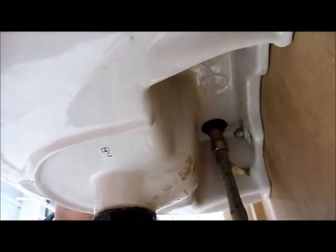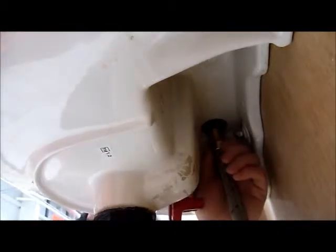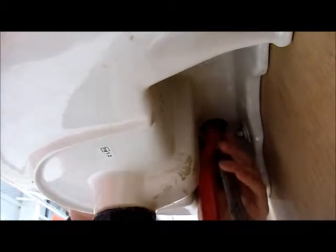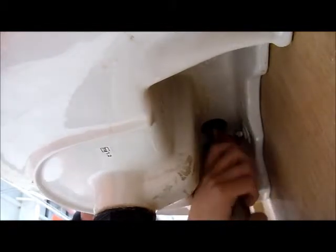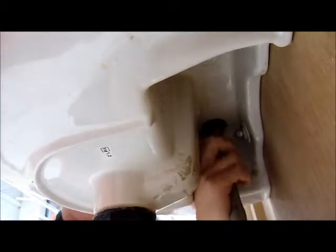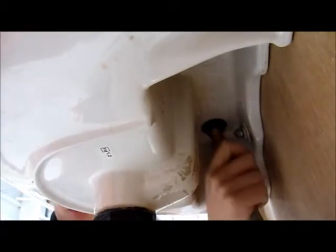So once you have the water turned off and you've relieved the pressure through the tap up above, you can find where your feed pipe attaches onto the tail of the tap, and getting your crank spanner or basin wrench, put the 1/2 side around the nut and turn it anti-clockwise. It's best to have a bucket or a cloth in under it, because there will be some water sitting in the pipe and you don't want it going over your tiles or carpet.